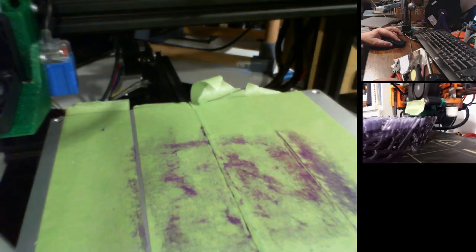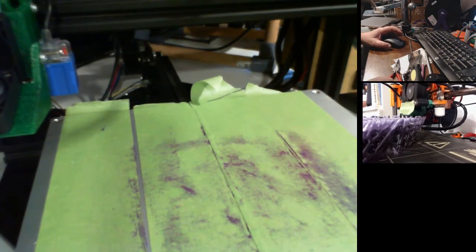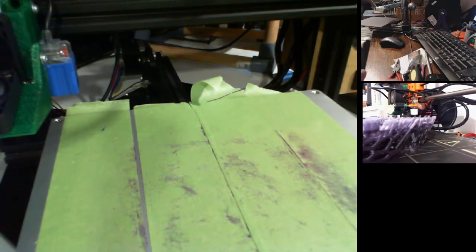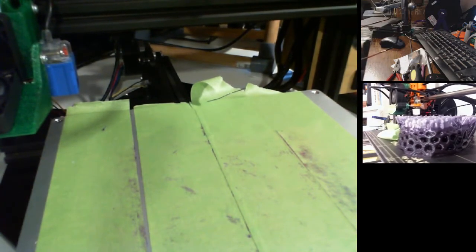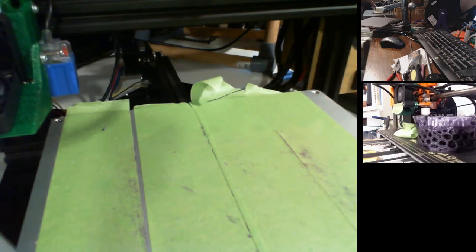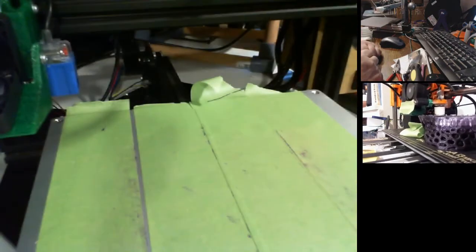The Raspberry Pi that I'm using to stream this is set up with Octoprint, and it's just the Pi, it's not a Pi camera, it's the webcam. I was using that with my M3D Micro, and as long as the camera works with it, there's really nothing to set up. You just do the standard installation of OctoPi, and you're good to go. Basically, you just connect to it through a web browser, and in OBS I told it that it's a web source, and it brings the stream into OBS and restreams it. The nice thing is that the Raspberry Pi does the encoding of the stream, so you can have multiple cameras and not increase your CPU load. That is a big bonus.